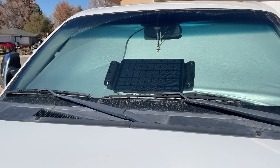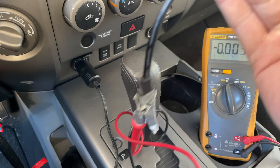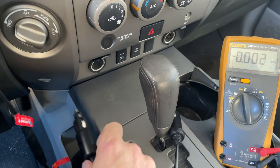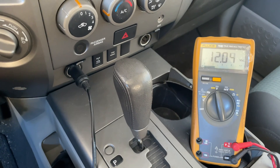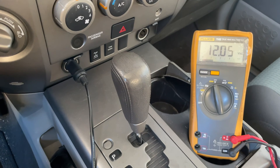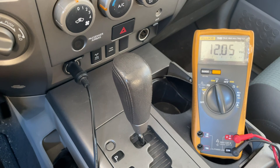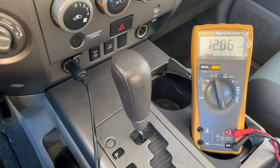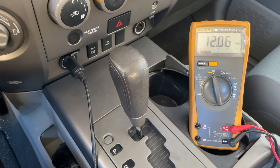The sun's been up for about four hours today. I've got leads from my meter plugged into the adapter — I'll unplug the solar panel, plug this in, and check where the battery is sitting. We're reading 12.05 volts. Like I said, this battery is pretty well sulfated, but there you go folks — the Renogy battery maintainer trickle charger, 10 watt version. If you enjoy these solar videos, click the video on screen now for another solar video where I made a solar powered off-grid workshop.